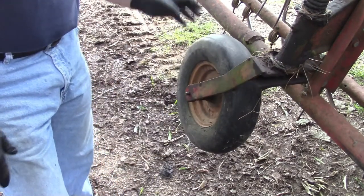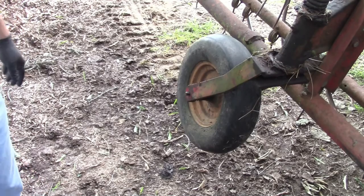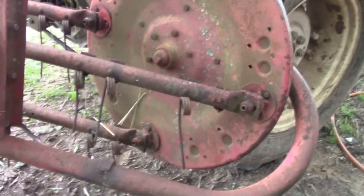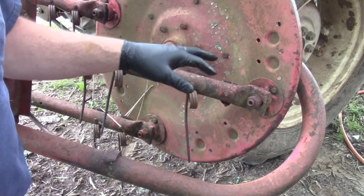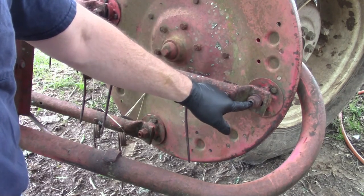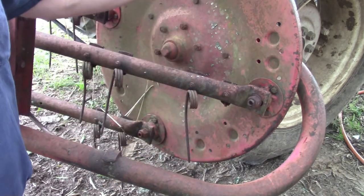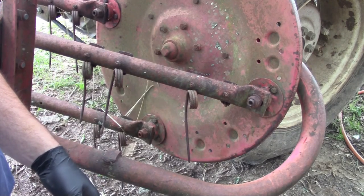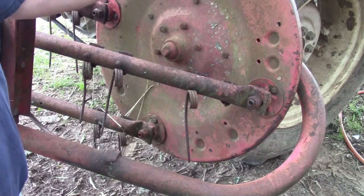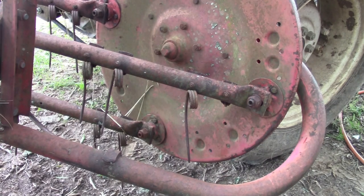I'll stick this back on, drop it on the ground, and park it and work on it as I can. I need to get all these bars unbolted — it's just three bolts holding each piece on and it'll come off with the bar. I'll tell you, it's a lot easier to go ahead and mount the flange and the bearing onto the bar before you mount the bar to the hub — don't try to slide the bar over the top of the bearing once it's mounted to the hub, it's just too hard to get lined up. I've also ordered some new bearings. So that's what I'm going to be working on — I'll bring you back for part two. Thanks for watching, please rate, comment, and subscribe.